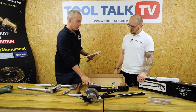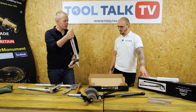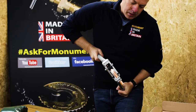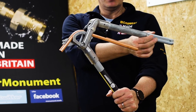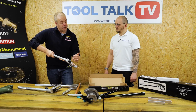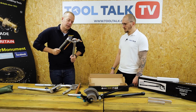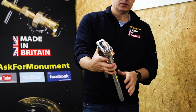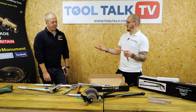I'll show you a 15mm bend and how you fit the pipe in. It's got the radius angles marked on it — they're never perfect, so we've gone between limits on them. As you go past 30, 45 — those markers there that you might be able to see. But as you bend the pipe, it tends to come back a fraction. So you may want to go past or let it come back, or go near it and then bend a little more. You go 30, 45, 60 and then you can go up to 90. And then it comes out nice and simple — you can see what a nice bend it creates.